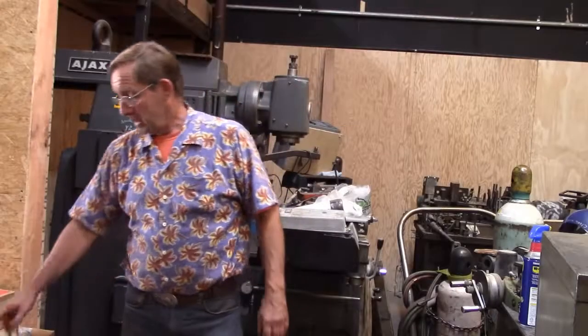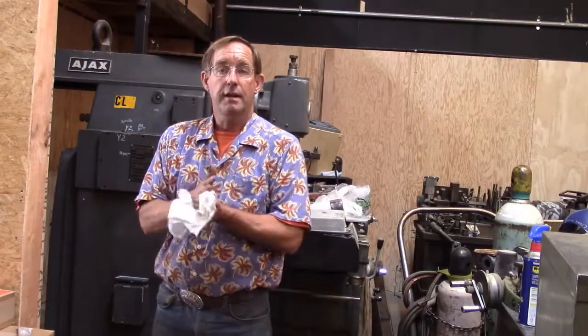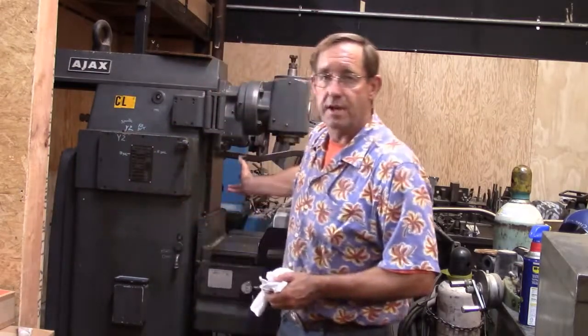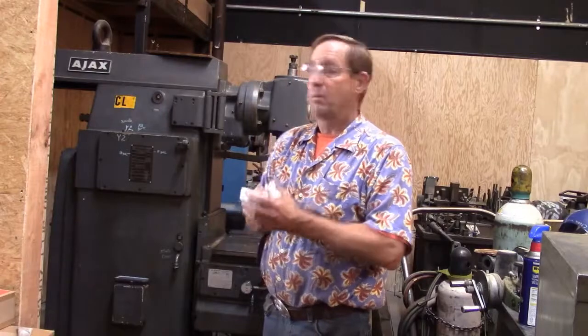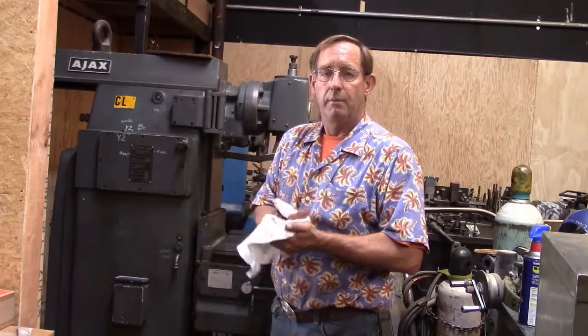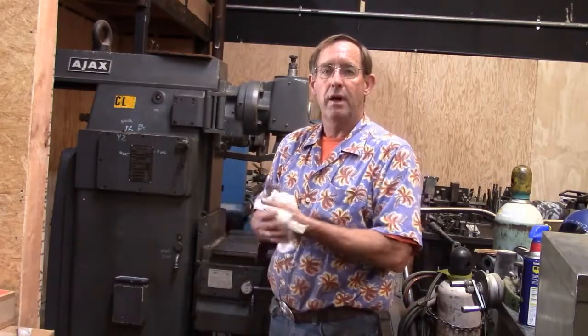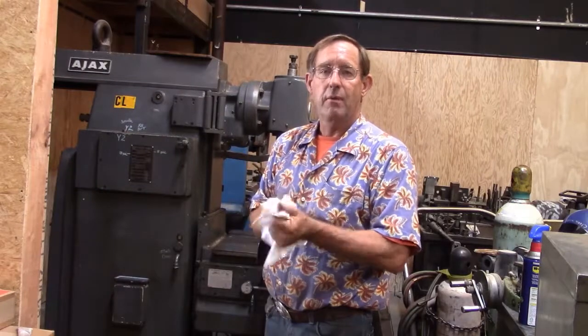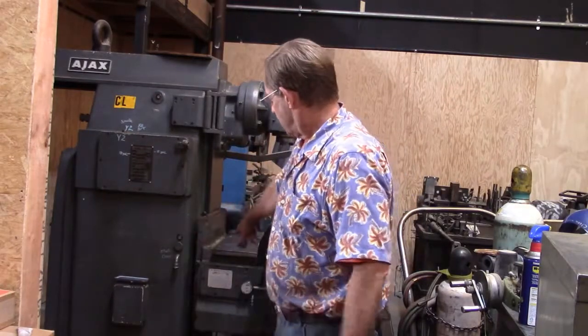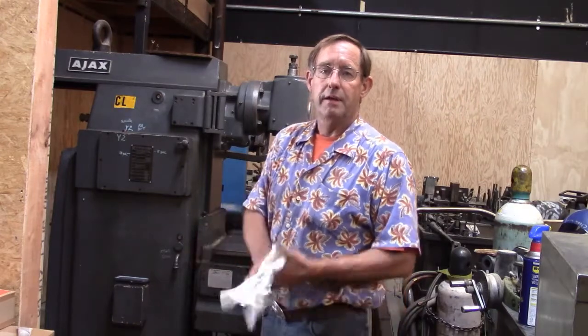Well, this is Jeff Erdman, E.D.S. Inc. Shandon, and we've just completed a job on our Ajax mill. We actually sealed up our little sight glass for our oil level up there. We pulled that out, put a new O-ring on it, put some sealant around it, popped it in, so she should be good. Then we went down to our rapid and standard traverse arm.